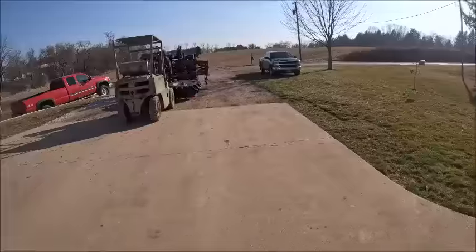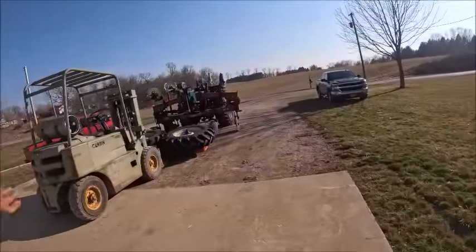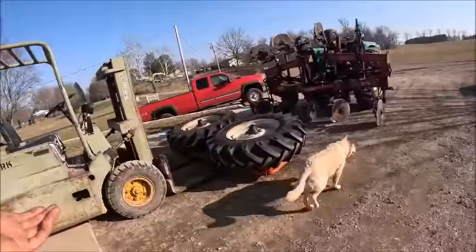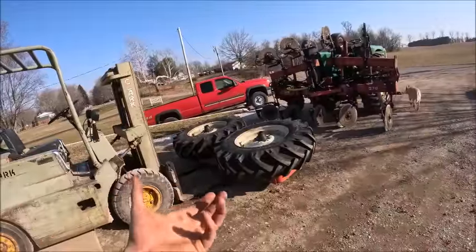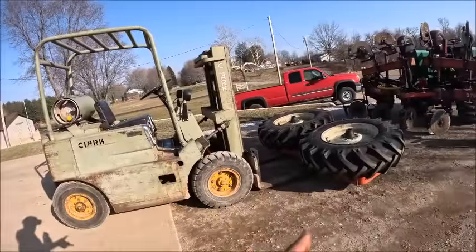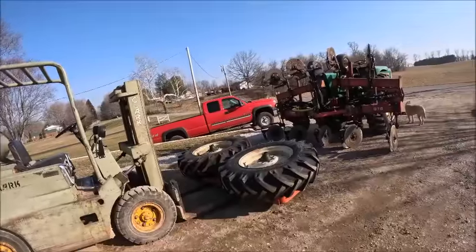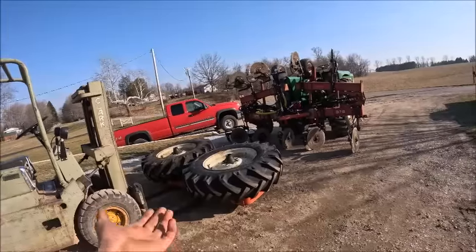All right, after doing the math and a little further discussion, it would be 125 overall once you figure in the 2 1/2 inches aside. And the way we're going to end up building the axle, the drop is going to be pretty darn short. Unlike that spreader axle where the spindle's welded right to the axle, we're going to make a sleeve that the spindle will slide into and pin it. That way the spindle's replaceable.